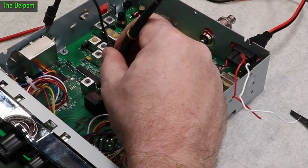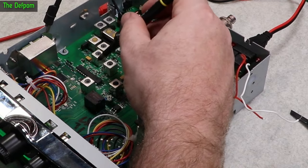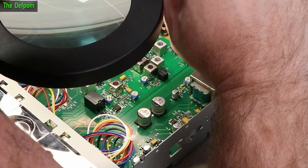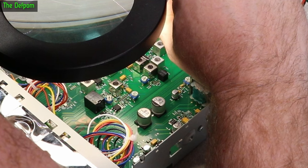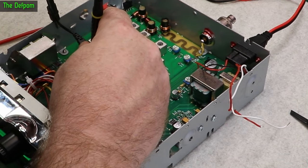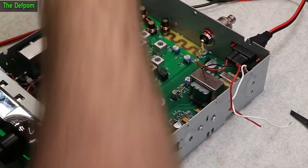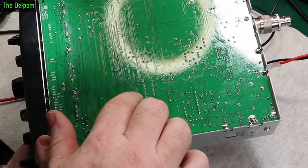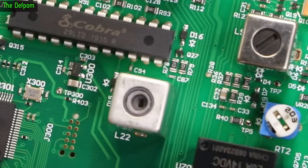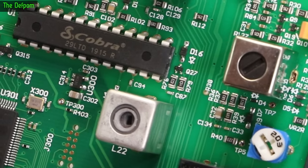So it's powered up — I've got something there. 15.3591 — yep, right there I've got something. But it's a tiny part; I'll need to see if I can even hook up to this. It's going through C87 and then it kind of disappears. I think C95 is the input, which is just here — yep, 5.12, that's right. And you've got a capacitor over here which appears to be the output. There's ground there. There's a little capacitor just down there — tiny cap, like an 0201 or something — C87. I've got 15.36 coming out of there.